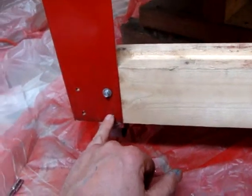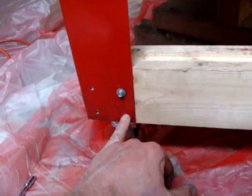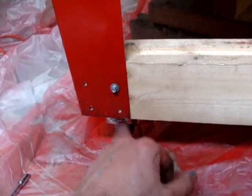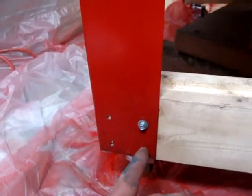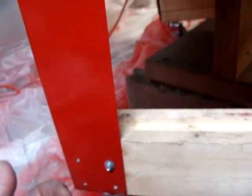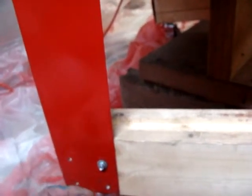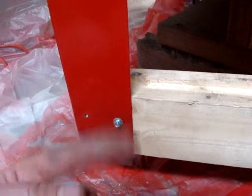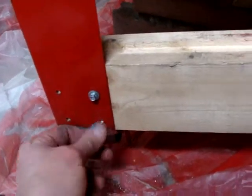I've got all of these clearance holes drilled through the sheet metal, and so now I've got to drill into the block in the back. The other thing I did is after I drilled the initial clearance hole, there's a lot of burr on the back. So to deburr it, I just use a slightly larger drill bit, and instead of drilling all the way through, I just run it briefly on the back side, and it knocks off all of those chips from the burr.